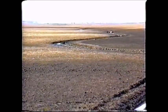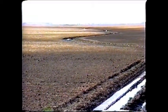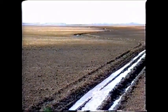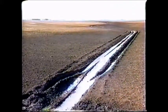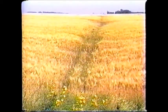The drainage line that is made in the spring acts as an excellent guide for constructing a permanent drainage ditch later in the fall. Making numerous passes allows for a wider ditch, one that will remain operational for many years, and at the same time shallow enough to allow the ordinary management and operation of a cropping program.